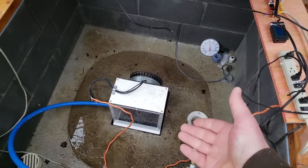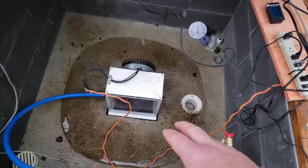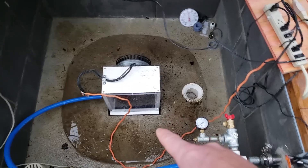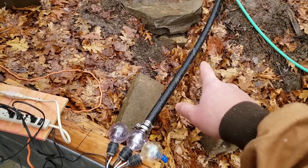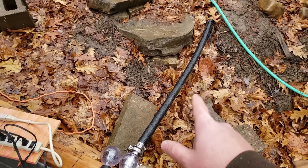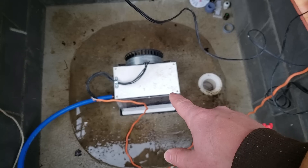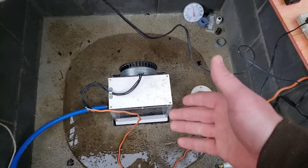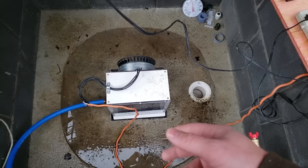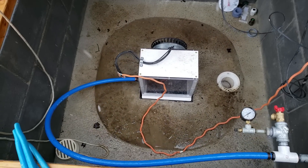I know I said this is a kilowatt system. It's frustrating because I know it can do 30 gallons per minute — that's what I designed this penstock for. An inch-and-a-half penstock should flow 30 gallons per minute with only about 5% friction losses, and 30 gallons per minute should be over a kilowatt. Here we are at 11 gallons per minute doing 100 watts. If you interpolate that upward, that's 300 watts in its current setup at full 30 gallons per minute with a larger nozzle.